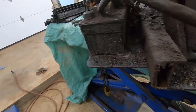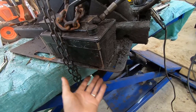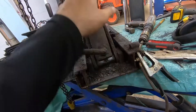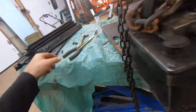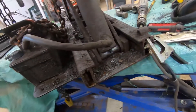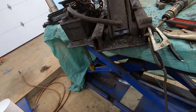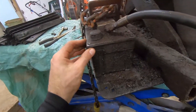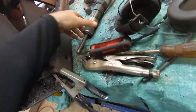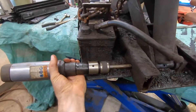The next thing to do is undo the bolts. There are two bolts that held the reservoir on underneath the platform here, so those two bolts came out. Then remove the set screw that holds the bottom of the hydraulic cylinder onto the shaft. My other video talks about how I extracted that stripped out set screw, so feel free to search for that. Now that the set screw is out, I'll be able to take my air hammer and pound the shaft out.